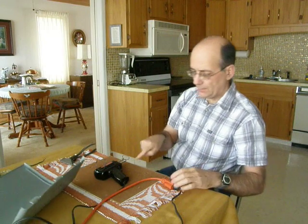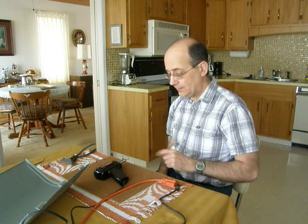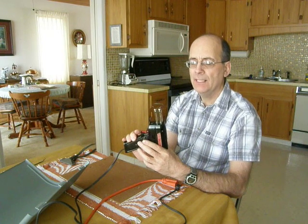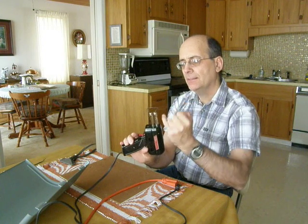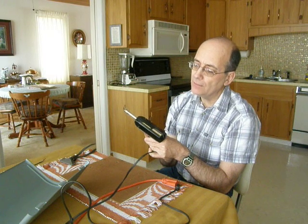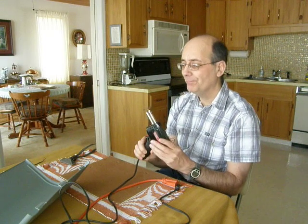Looks all right. I've got a switch wired in and I've got it set up so that I can unplug it very handily, so I don't have to worry about trying to quickly unwire a switch. Now, to show you what the wire looks like — I've just bent it, and as you can see it attaches with two nuts that have been drilled out. The wire passes through the nut and makes a 90-degree bend to protrude out of a side hole, so when you tighten the nut it makes a good tight electrical connection. My gun is good and hot — it's rated for a duty cycle of one minute on and four minutes off, and I think I've reversed that, so I haven't been nice to it, but it holds up.